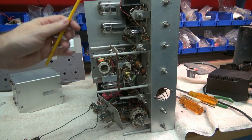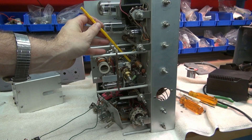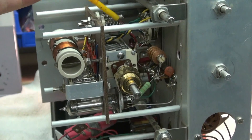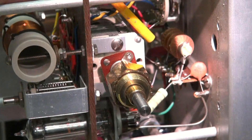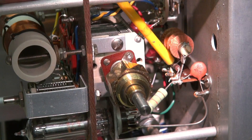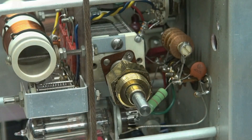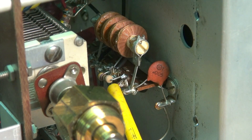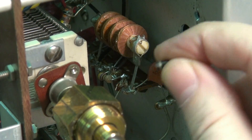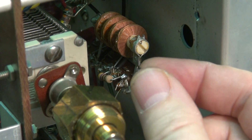The face is finally removed — that was a joy. The resistor we're after is right in here. If I zoom in you might be able to see it — let me get a little light on the situation. There he is, Mr. Fried 470 R5. We have a successful replacement. There's the new 470 ohm in place. The old one came out in pieces — it was really French fried.